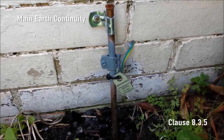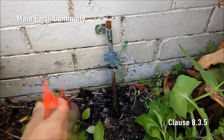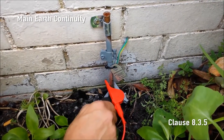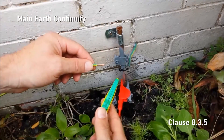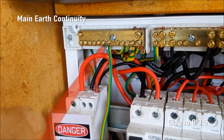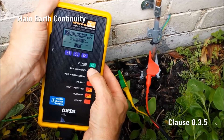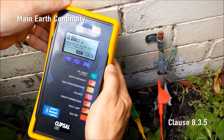Main Earth Continuity. Firstly, the resistance of the main earthing conductor from the earth electrode to the multiple earth neutral (MEN) connection shall not be more than 0.5 ohms. Using the 493L optional test lead set, attach SparkyMate's active and neutral clips firmly to the earth electrode. Attach the SparkyMate earth clip by way of an uncoiled earth extension lead — with a known resistance measurable by SparkyMate — to the MEN. Press the earth continuity button. SparkyMate measures and displays the total resistance of the main earthing conductor and the earth extension lead.